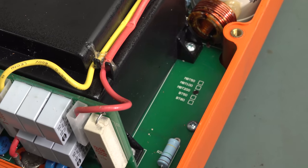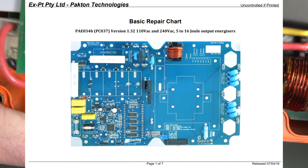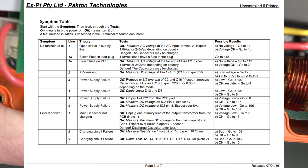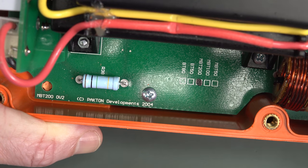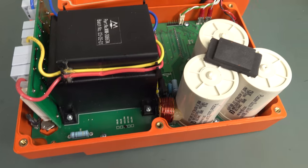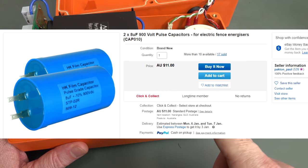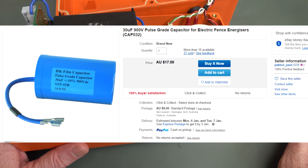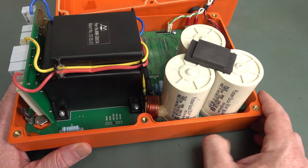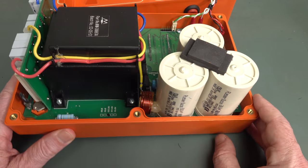Maybe I can get some info on the BT models. This is 2004 vintage. If you go to their website, which I'll link below, they've got some amazing repair guides — PDFs with instructions on how to troubleshoot and repair these things. Unfortunately they don't have this particular model and there's no schematic in the ones I saw. They do seem to support these products. They also have an eBay store where they sell replacement capacitors — the same 30 microfarad 900 volt rating, but not the Plessey ones anymore since those aren't made in Australia anymore. The replacements come from HK Capacitor — I assume that's Hong Kong Capacitor.